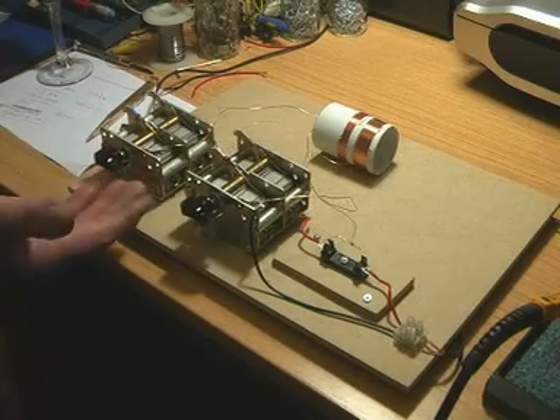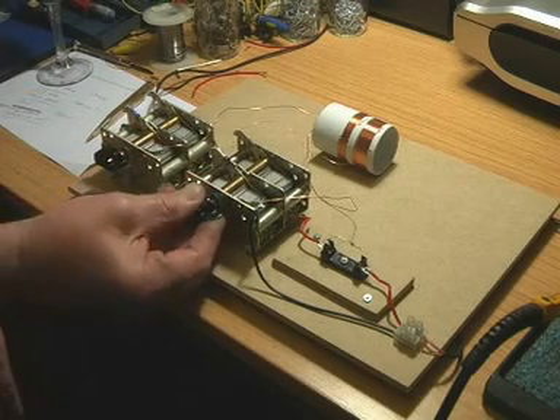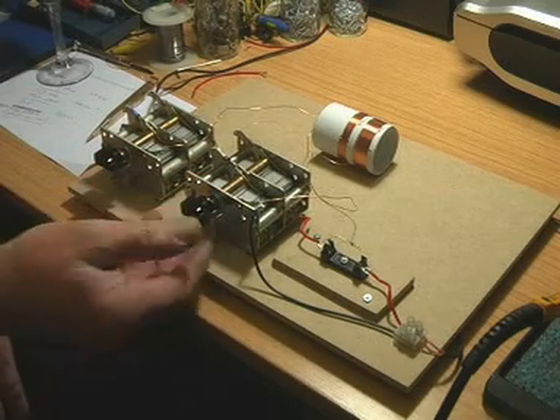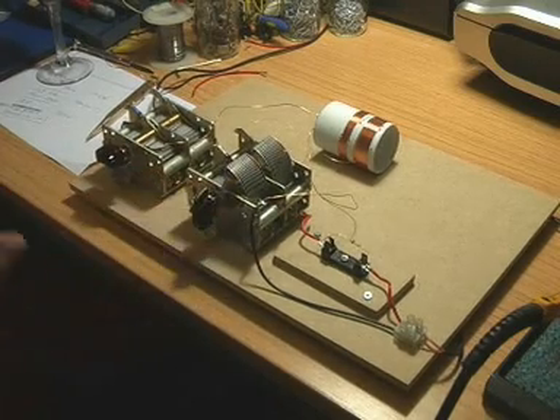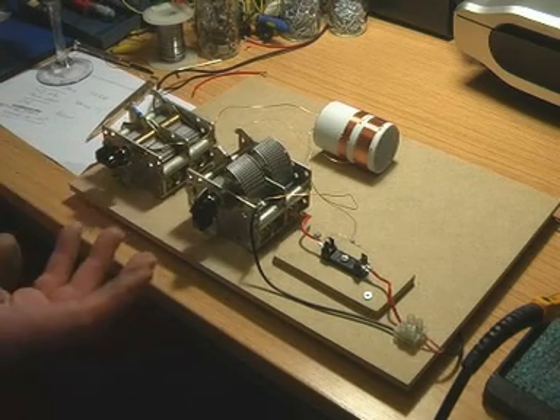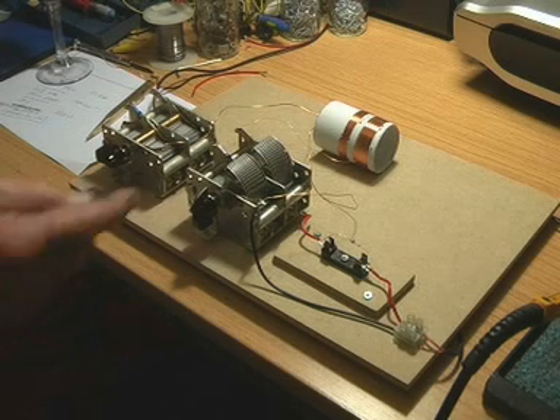This is amazing — I've surprised myself. There's nothing wrong with the circuit; it's actually working. It's just become so selective that it isn't tuned into anything, so there's no sound. The reason we can't receive anything is because there's nothing in this position. What we have to do is actually operate the tuning capacitor. And it works — we've actually got one of the stations in the clear.